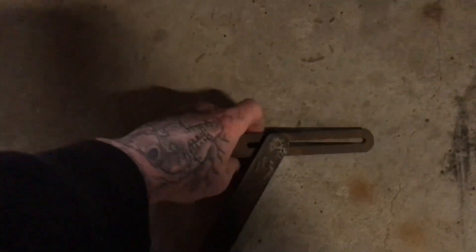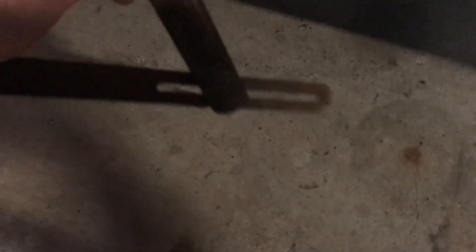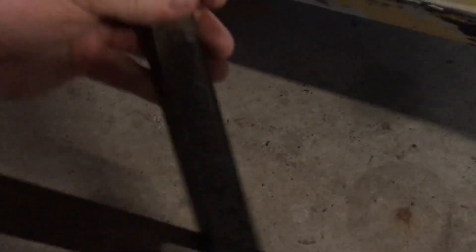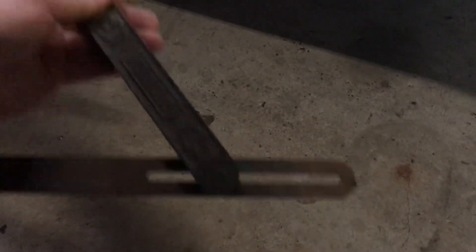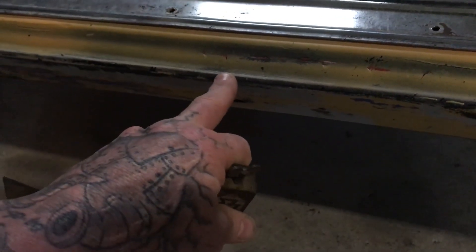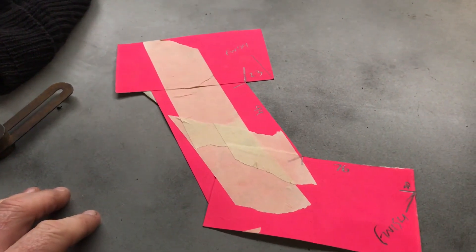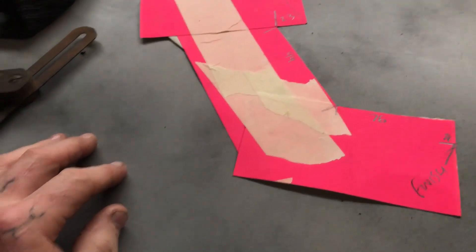That's when I use a sliding bevel. You can also use a sliding bevel to make your template, but I just prefer to make my templates straight off the car. So that's my lower angle - I'll lock that up and when I make the two sills I'll have that angle for making the first fold underneath, and then I'll reset it when I do the top one. That's the easiest way to make a template if you're going to get somebody else to do your folds for you.